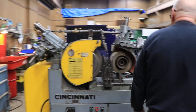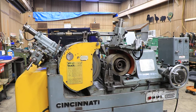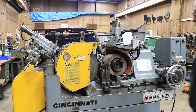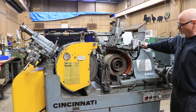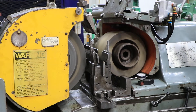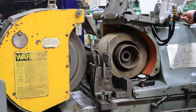The quotation is going to tell you a lot about it, but the machine's been completely updated. Behind the door here are all new components, which we'll show you in the still photos. This regulating wheel has been updated with a variable speed drive where I can increase or decrease the speed, and we have the digital readout up on top here.